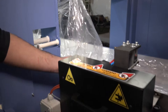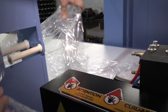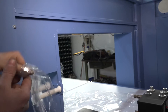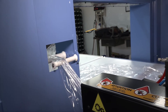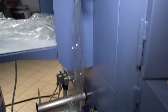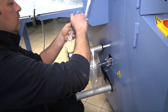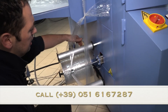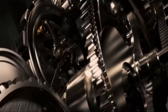Now pull it manually and drag it from the touch screen till you reach the two rollers, parts of the film waste dragger. Make the film waste pass over these two white small rollers and make it go through till the final film waste rewinder. The film dragging is made by manual film dragging from the touch screen. Now you just have to tie the film to the film waste rewinder. Now you're done.